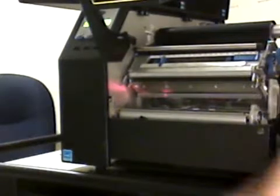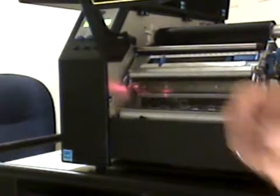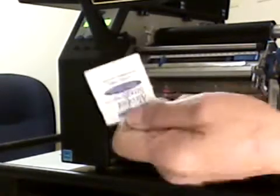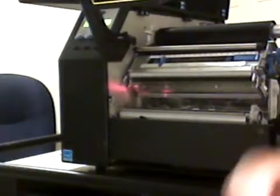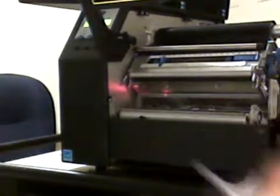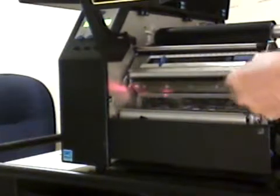Now while we've done that, we've put our hand on the printhead. So the proper cleaning procedure is, anytime the ribbon needs to be replaced, of course the ribbon won't be on the printhead now, it's time to clean the printhead. To do that, you can use an isopropyl alcohol wipe or use 90 to 91 percent isopropyl alcohol on a soft rag, and then just apply that across the printhead assembly, again to clean your fingerprints off of it and also to maintain the quality of the printhead every time you change a ribbon.